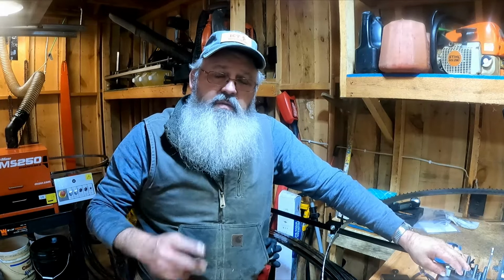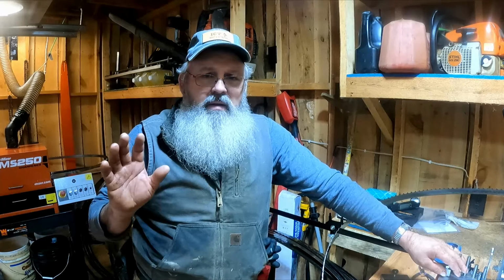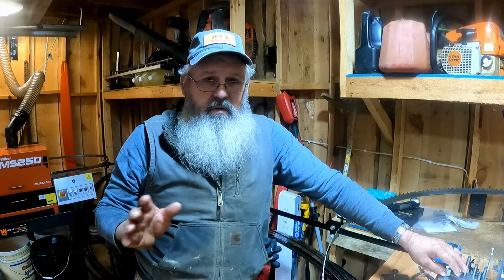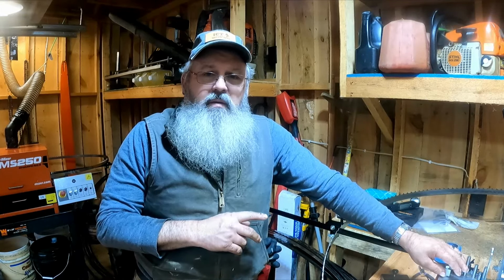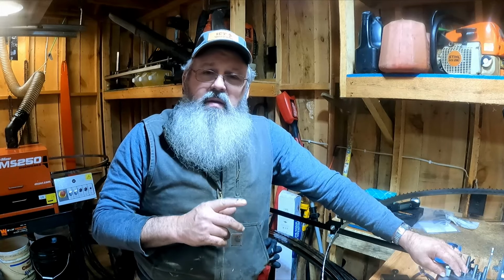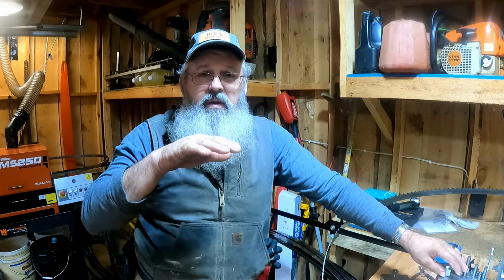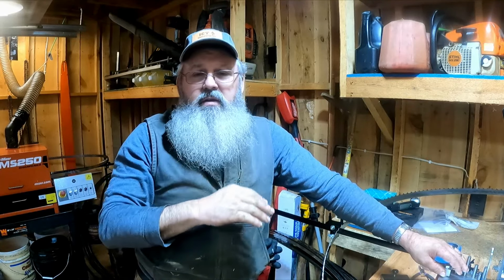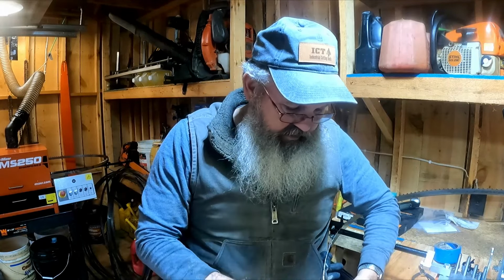So that being said, this is the first time we've sharpened these blades for this customer. I don't know what happened to them before, but they weren't set where I was running. I'm gonna tell him to call me when he runs these and see if he's happier with them being set around 25 thousandths versus what they were. It should stay a lot flatter in the cut, should be a lot more dependable. I'm gonna double check it here before we put it in the pile.